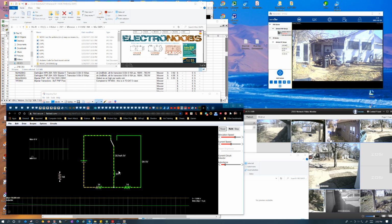That's how it maintains that magnetic field. But, like I said at some other point, if this thing were a superconductor, it could basically maintain that magnetic field on its own indefinitely. You could have zero resistance in the circuit, an infinitely circulating current like an MRI magnet has in it.